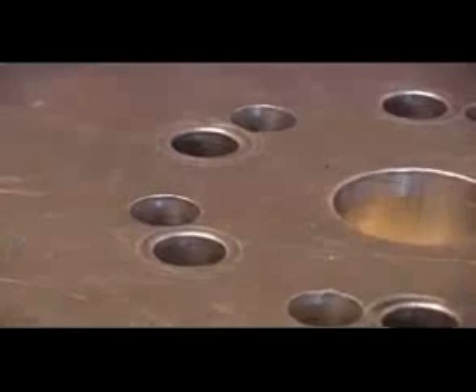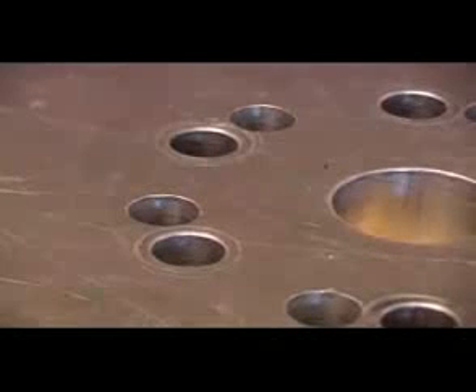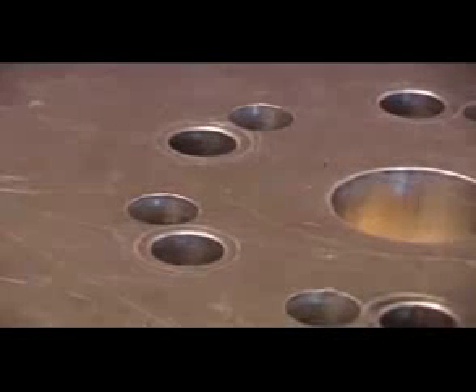Going toward the centre of the rotor, you will notice holes drilled in. This particular motor has 12 holes. These are 20-degree offsets to allow the rotors to be offset 20 degrees from each other, allowing the motor to run.